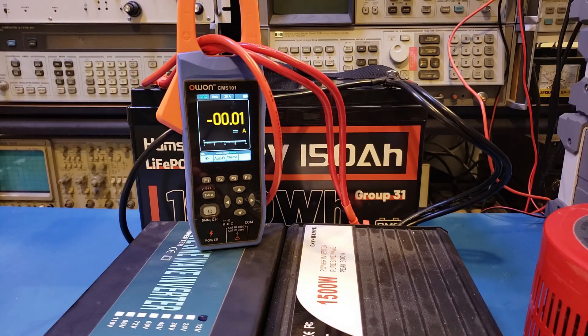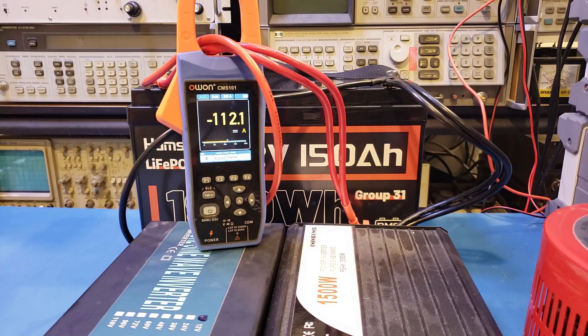Let me first turn on the first inverter — this one is connected to a heater, which is going to draw some current. That heater is drawing around 10A. Let me turn on the other inverter as well and crank up the variac. We'll go right to around 110A. You can see that right now we're right around 110A, and I would like to run for a while to see how well it holds up. We've been running like this for about five minutes now and everything seems to be holding up.